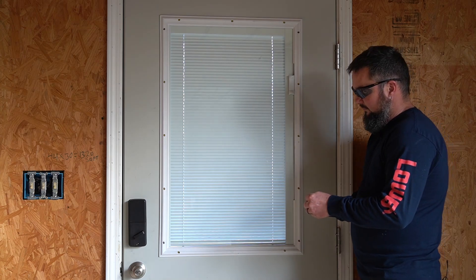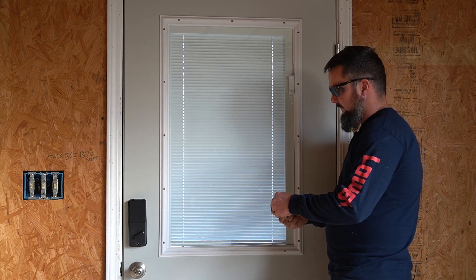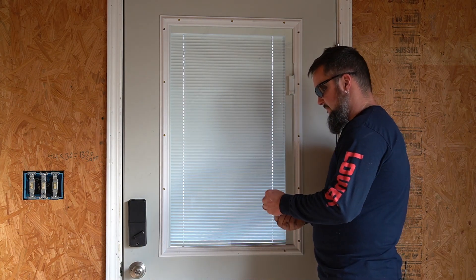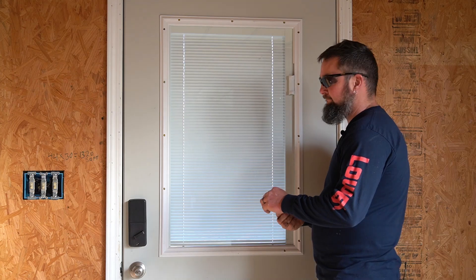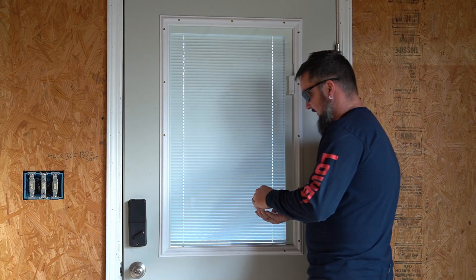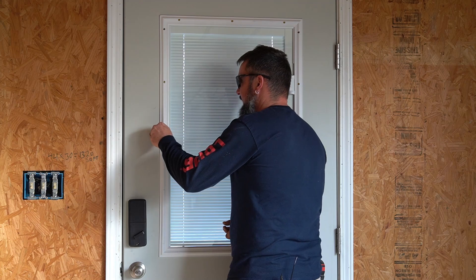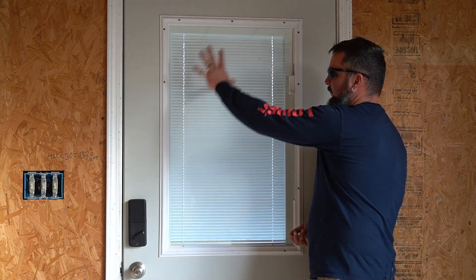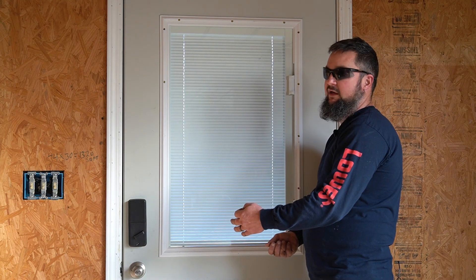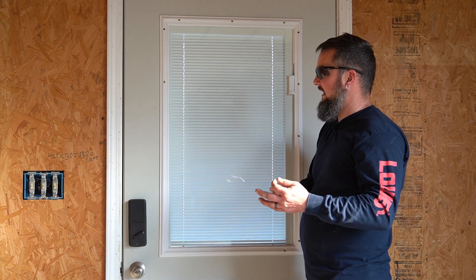These little pads that come with the door are very handy — they kick out the weather seals on the bottom. If you see daylight, remove the sticker, pull the pad out, put that little wedge in there and it'll take up the daylight. I don't use them on every door because they're not necessary on every door, but if you've got a little bit of daylight you can stick those pads in for a good seal. They work everywhere, and most new doors give you two. As for the blinds: there are three magnets in the casing; you just push up to make them go. It does take a little knack to get the plugs in there — you might have sore thumbs when you're done — but it's just a matter of making sure the bevel is in the right spot.